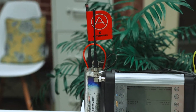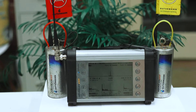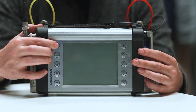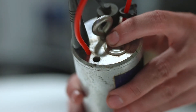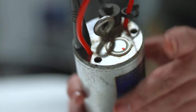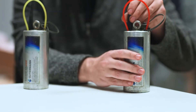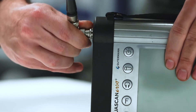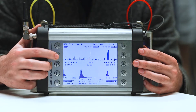The Scratch Test can be performed with the AquaScan 610, 620L, and TM2. First, power on the correlator's receiver and the A and B sensors. Connect the antenna flags to their corresponding sensors and the antenna arm to the receiver. Then, enter in a new segment of pipe of any length and diameter.